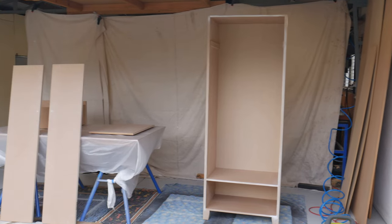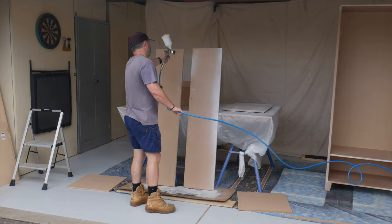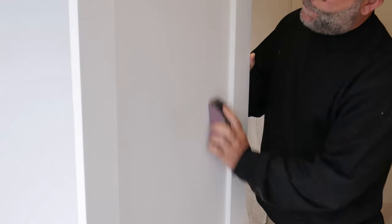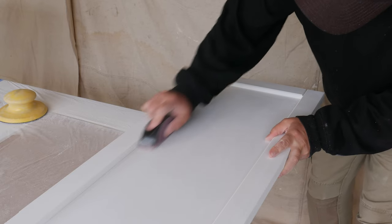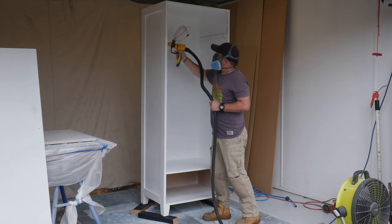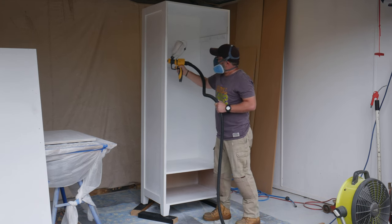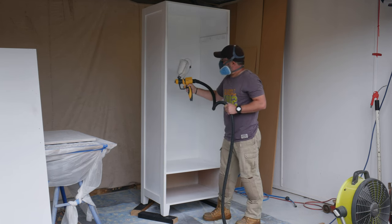All got stripped down, and after stealing all the kids' bed sheets and setting up a painting area, it was time to apply the undercoat - firstly cutting in the edges and then filling in between. After the undercoat it's a good time to sand or fill any imperfections, as the paint makes them stand out. The wardrobe got two coats of a water-based enamel, and I learnt my lesson from day one and wore a respirator this time. I also switched over to my Wagner sprayer, which is super user-friendly and gave a great result, especially with water-based paints.